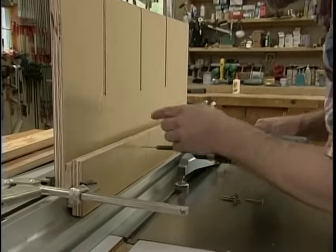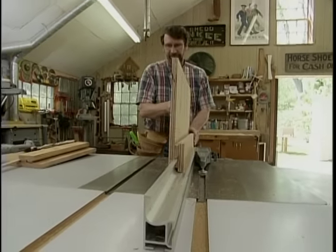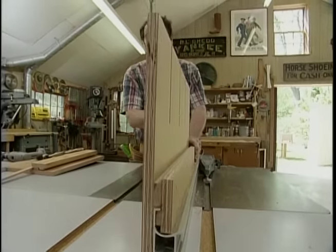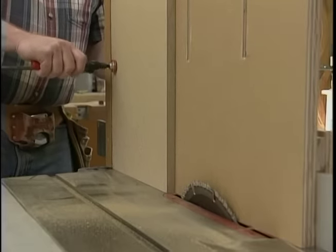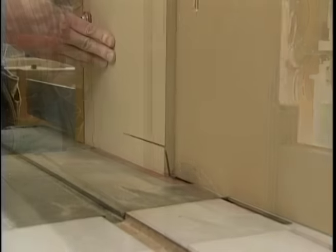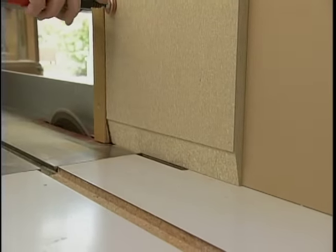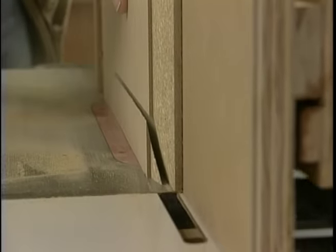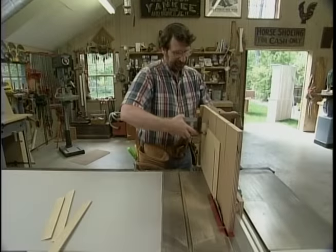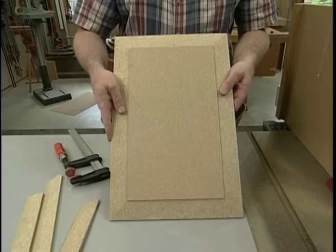And finally, some holes for screws that will pull the sandwich together. That works great. Now let's make a raised panel. I'm going to use a piece of 5/8-inch straw board, and I've tipped my saw blade to 10 degrees, and I do the narrow ends of the panel first. Once the saw stops, I can pull it back through, turn it on another side. Four passes will make a panel. Just a couple of minutes — a raised panel. This is going to be a very useful jig.